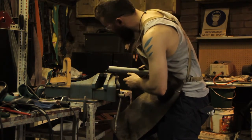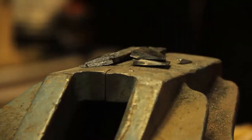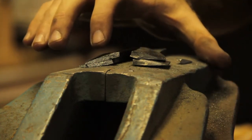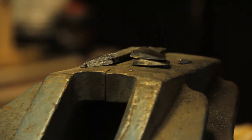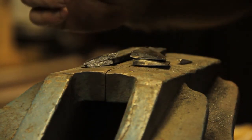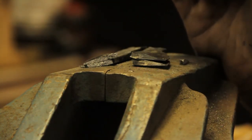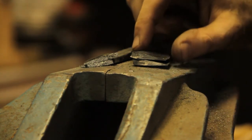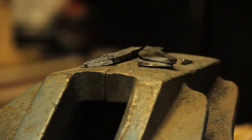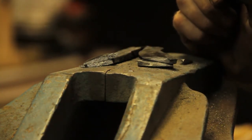Whoa. Disgusting. You can see the piece that we didn't do any grain refinement to — we didn't even normalise it, we just took it out of the forge and straight into the oil. The grains are huge, they're like pieces of sand. In comparison, the piece that we did our normalisation grain refinement on, let it cool down to room temperature, soaked it at the correct temperature and then quenched — it's smooth and silky, kind of velvety. Near the spine where it's a bit thicker the grain's there, and the steel was a bit more ductile when I snapped it, I could feel it. But right near the edge they're super fine, which is just what you want for the edge of your blade.